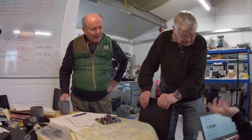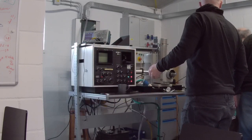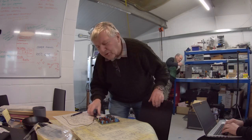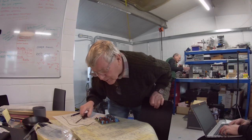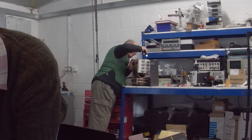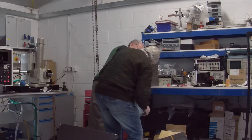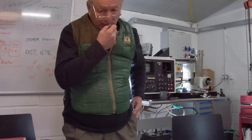It's precisely right, isn't it? Okay. There's nothing left. So just on there if you can. You're right. So which one is it there? That's the next question. If you tell me. Oh, the one I would be most interested in, Bernie, would be TR3. TR1, 2 and 3, and it's TR3 of that trio. And HFE classification, it's an O, so it's 50 to 150.